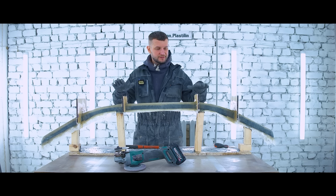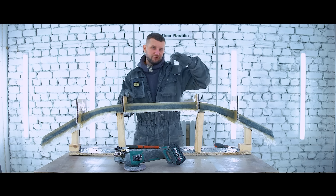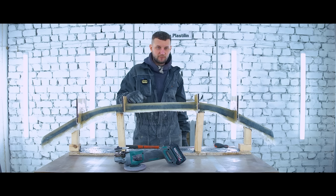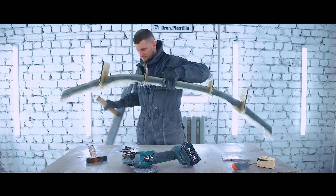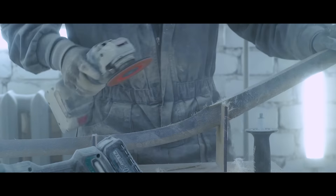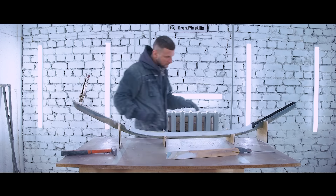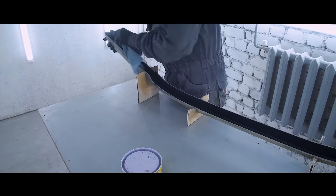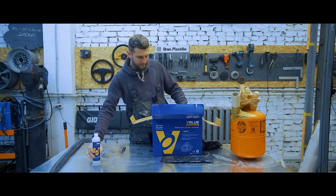Now it's time to do the unboxing. These plywood supports — you might think it's just a stand for the matrix, but it's not. All the U-shaped pieces, when the resin dries, they shrink and bend, so these side walls stretch. To avoid this, I installed plywood supports that will prevent the wall from collapsing and folding. Now we're going to remove the dummy from the matrix — I predict we're going to break it because this shape is complex; it has this groove in the middle. This is the main difference between a soft silicone mold and a solid fiberglass one. We changed the rules of the game — this time we need this solid mold with an upper lobe. And the self-fulfilling prophecy came true: our glued wooden master model broke. But that's okay, because we managed to make a matrix out of it — even two. That's when we got a long-awaited package: the fusion delivery with everything we need to work on carbon properly.